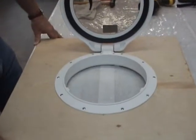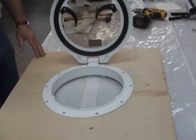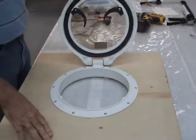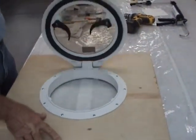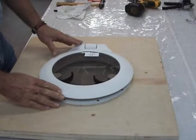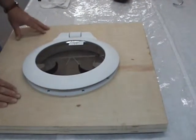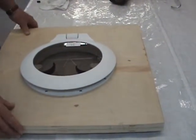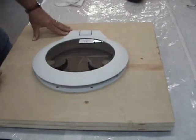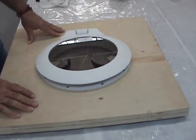Now that we have finished the installation of the new Jim Black 10 round ventilation hatch, we want to take a minute and review some of the features. Our silicone has dried and our hatch is in an operable condition. The hatch has tempered glass, which has excellent rigidity and excellent optical clarity — it's easy to clean, chemically resistant, and will last for many years in the sun. The polymer, being a polyolefin based material, has been tested in South Florida sun to meet 10 year standards in xenon arc testing.